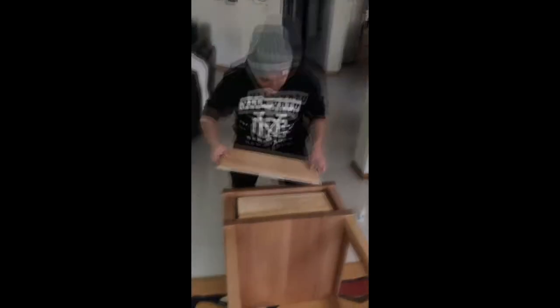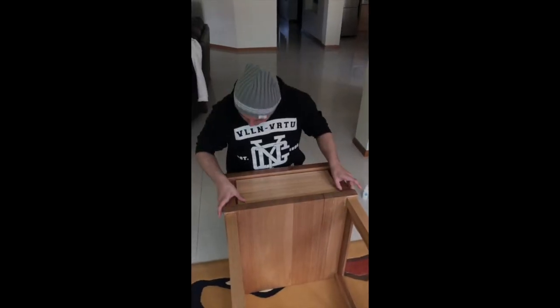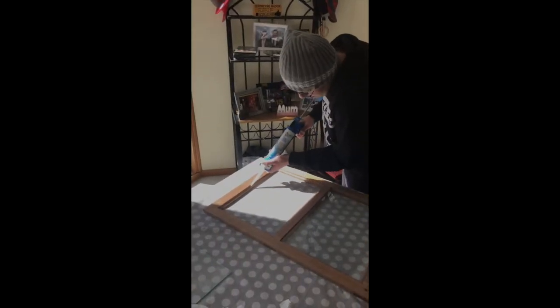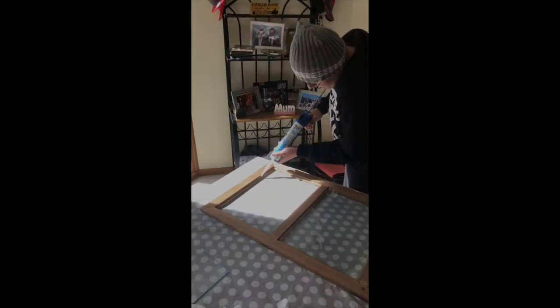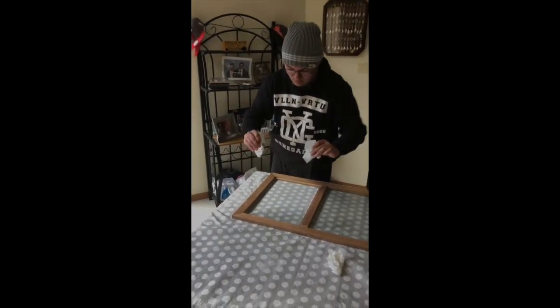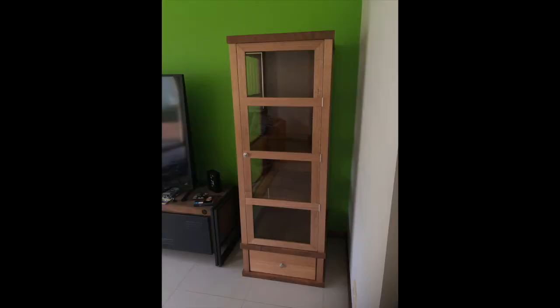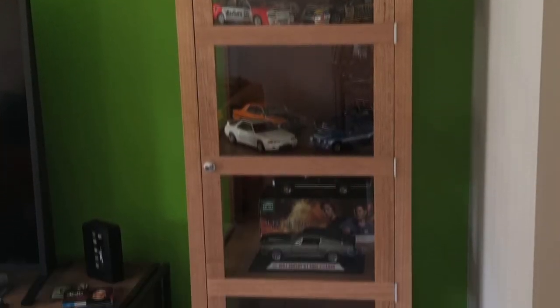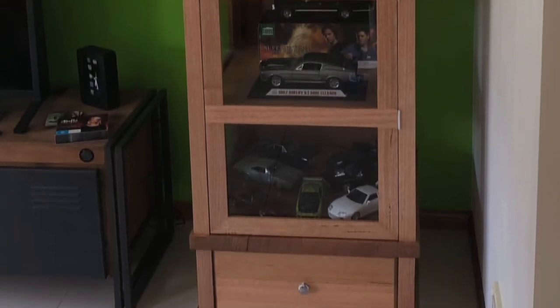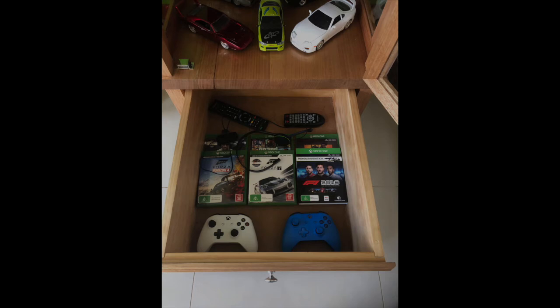The drawer front was then glued to the project. Using a glue gun, silicone was slowly applied to the trenches of all frames in order to hold the 4mm thick glass. We had to be careful of the sharp edges of the glass. All the hardware was then fitted including the hinges for the doors, the drawer pull and the door handle. So there you have it — the timber display cabinet successfully adhered to the client's needs, adding several areas of storage for his cars as well as a large drawer, fitting the retro theme of the rumpus room.